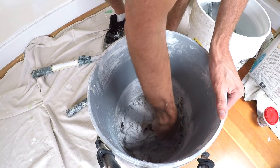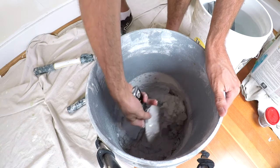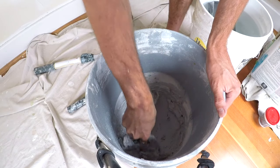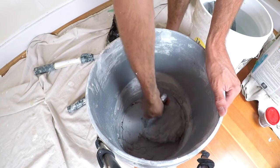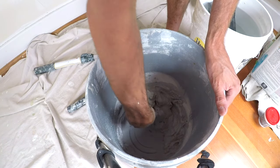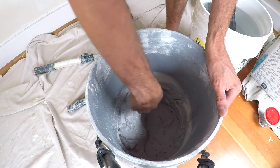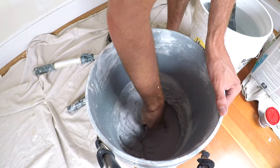The glue makes the mud feel way stickier — there was quite a lot of glue in there. I want to make sure that it's not too lumpy, because otherwise I've got some plain water quick set and some glue water quick set mixed unevenly. We want to make sure that it's fairly uniform and mixed through, although the mixing action on the wall when I start spreading it is also going to help. This is some gluey, sticky quick set.